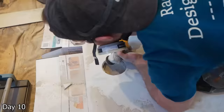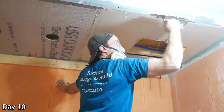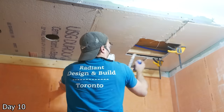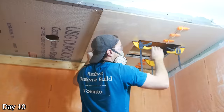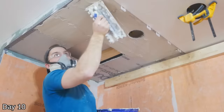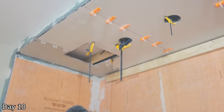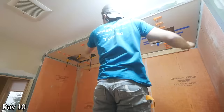Just continuing with the rest of the ceiling. I have a ledger board on the side that I just screwed in — it just made the install a little easier. These tiles are really heavy, especially when you get the thinset on there. So working overhead like that, having that ledger board was just a nice little comfort. If I needed to rest it down for a sec, I could. And then using the wedge-style leveling system, getting these pieces all perfectly flush with one another. I got the suction cup tool — having one of these is going to really help with a tile size this big, as there's nowhere really convenient to grab them otherwise.